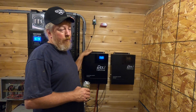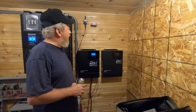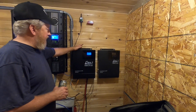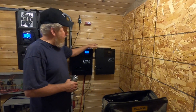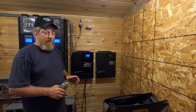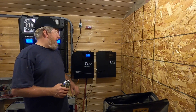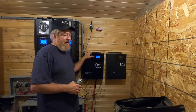The other difference is electrically speaking: this one's 3,500 watts, this one's 5,000 watts. This MPPT is good for up to 145 volts, and this one's good for up to 500 volts — so that's one big difference. That's the big difference between the two: the PV charge controller, 500 volts versus 145 volts. Either one can be overdriven in power, so you have to be careful you don't overdrive it voltage-wise, because they won't tolerate that.